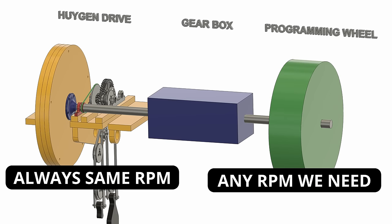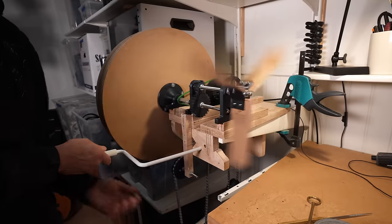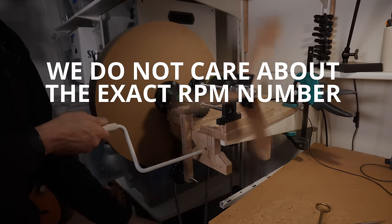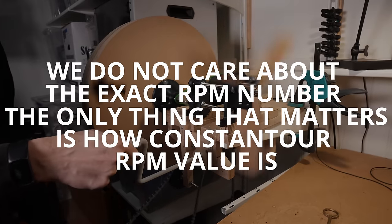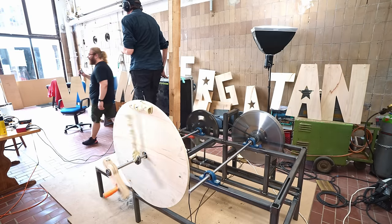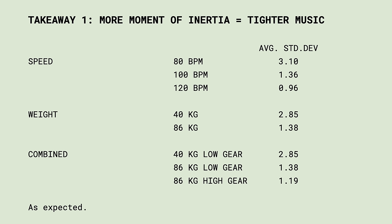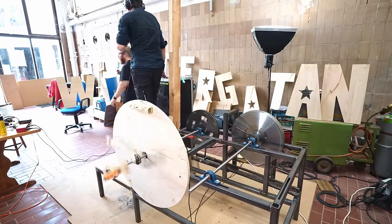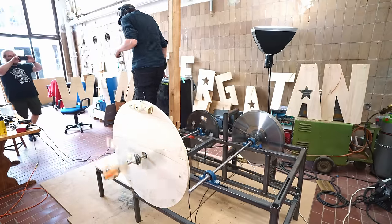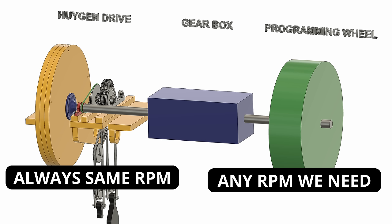That means we can have an operating speed that the system can be fine-tuned to and that the moment of inertia of the flywheel will always be constant. The only thing that matters is how constant our RPM value is. Furthermore, separating the rotation speed of the flywheel from the music tempo is important anyway — as shown in the metal prototype from Germany, higher moment of inertia equals tighter music. If the flywheel and music tempo were intertwined, the slower songs would be playing less tight than the faster ones, and we can't have that. So separating power input and flywheel rotation from music tempo is a form-from-function design decision.